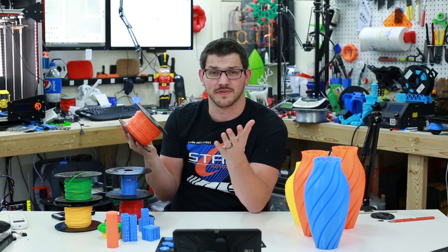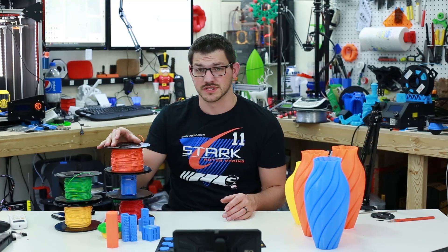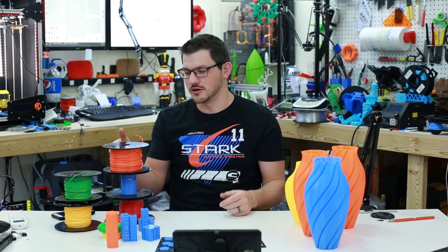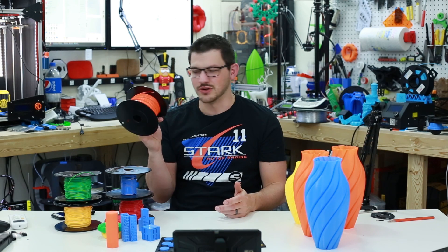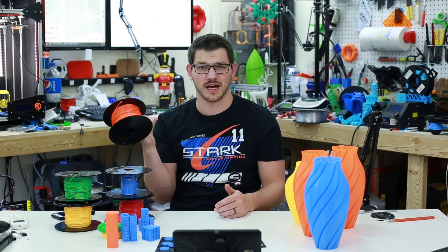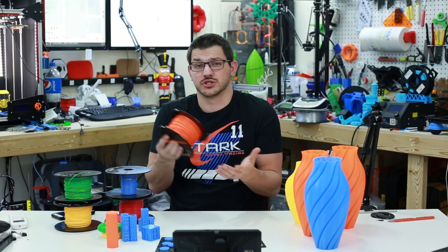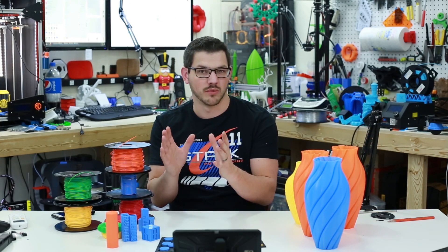It's probably better because there's less movement in the spool — I'm sure there's a reason why they're doing it, maybe just because it's cheaper. I just don't like them because I actually have to print a totally different spool holder just to hold these on most of my printers. Some of them are suspended above using a piece of PVC pipe and some brackets. The problem with that is because there are little screws on the ends using some cap head screws to hold it on so it doesn't fall off the arms — it no longer fits into these holes. That's just goofy. So I end up having to print a totally different mount for 2020 extrusion, or I've been using a very simple spool holder design that sits on the ground using four 608ZZ bearings — these just sit in and roll. It works like a charm, but I like having the spools mounted somewhere so they're up out of the way.